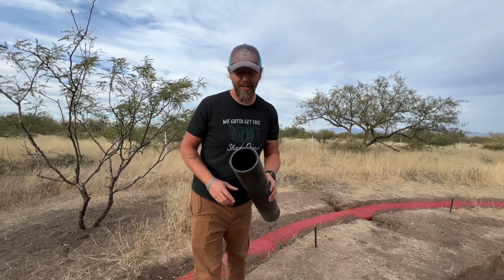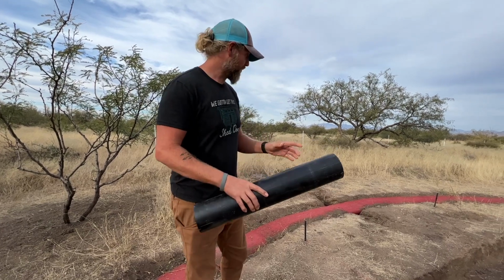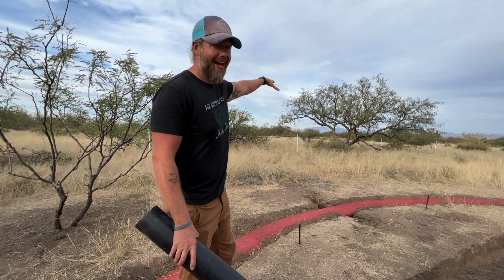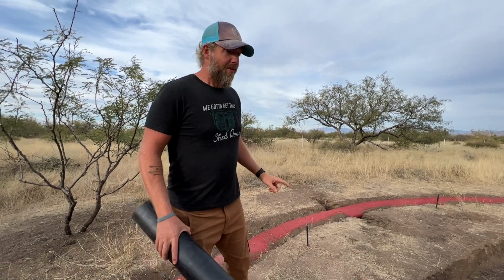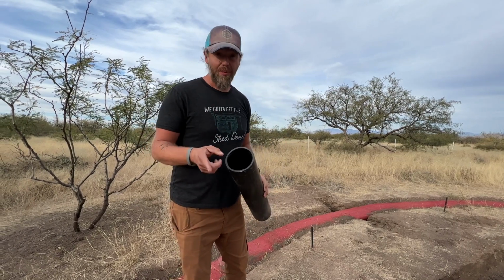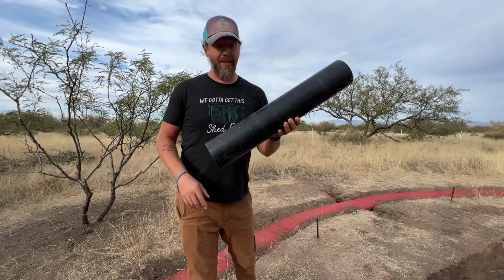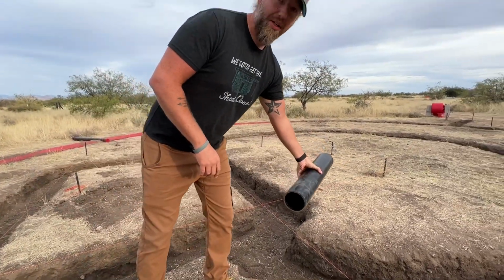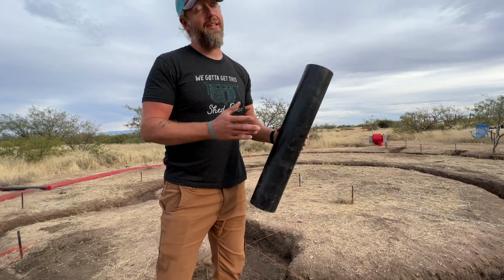So before we start laying earth bags, we have one more piece of pipe to lay underneath the bags because of water. You might remember we trenched over here because we're going to have a water tank that catches water off the roof of the coop outside the outer wall. We need to bring that water back in so that we can irrigate the garden. But we also need water to go into the chicken run because chickens need water. So instead of having to go all the way outside and get water and come all the way back in, we're also gonna run this under this wall over here, right around here. So it's gonna be down under the bag, the same thing as that. That way we can pop water up on the inside and whoever's taking care of the chickens can just get water from there.